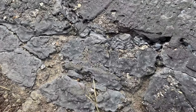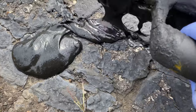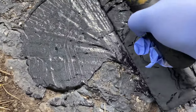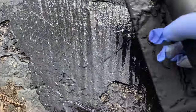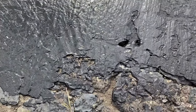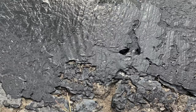Let's try it on some of the alligatoring surfaces. This is the area with the alligator skin and I can just slop some of this on here and push it through. It just makes short work of that. It's going to help bond those pieces together as well as give me a flat surface so I can come back, fill in anything that shrinks as it dries, and then seal coat over it to preserve some of these broken areas.